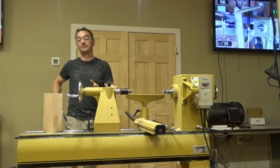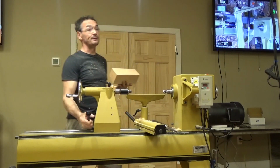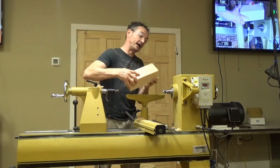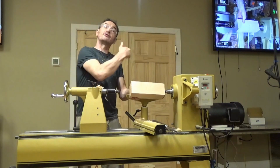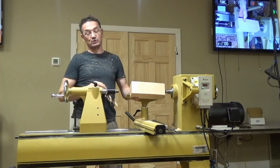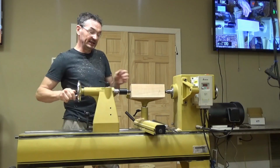And that's when I realized that the Irish grind required the gouge to be pulled round. The reason it couldn't be pushed round is the nose of the gouge in the Irish grind is 60. You can't push 60 degrees. It'll ride right off the surface. But the wing on the Irish grind is 40, because the Irish grind does not have a grind that is even all the way around.